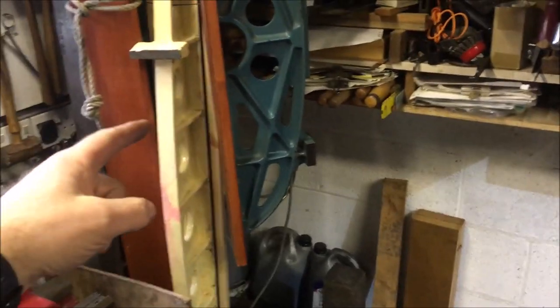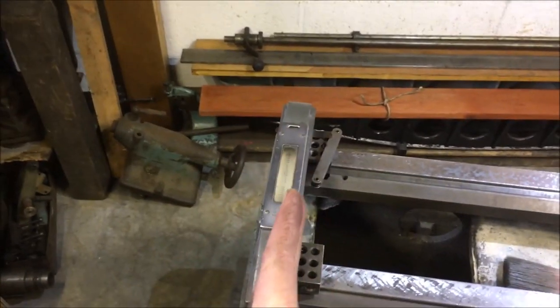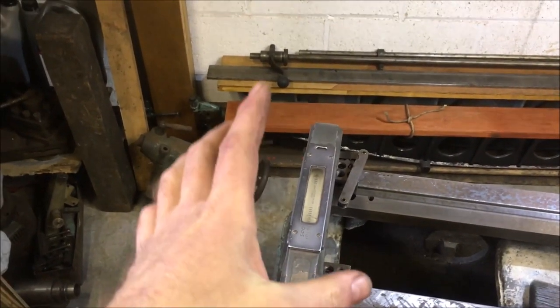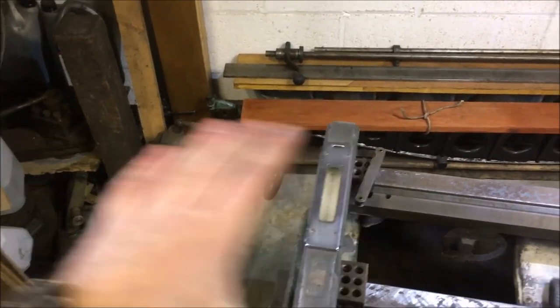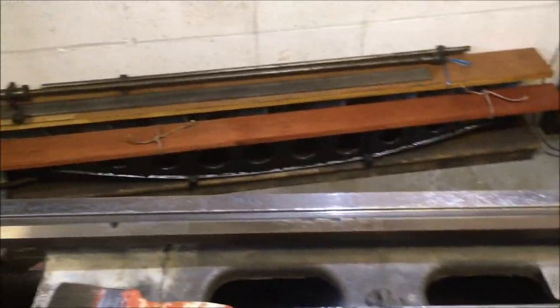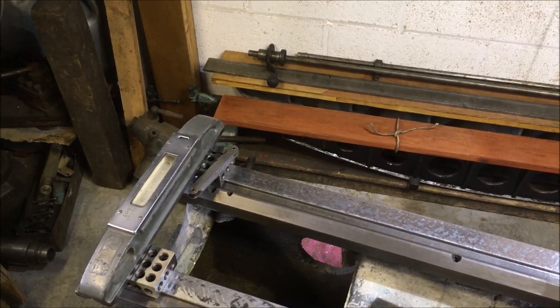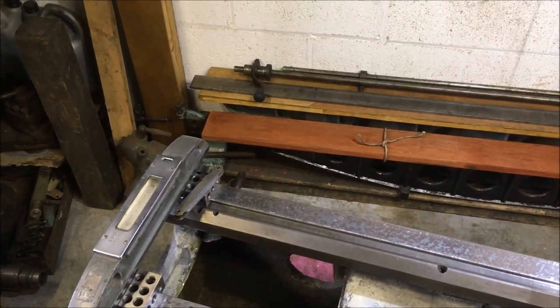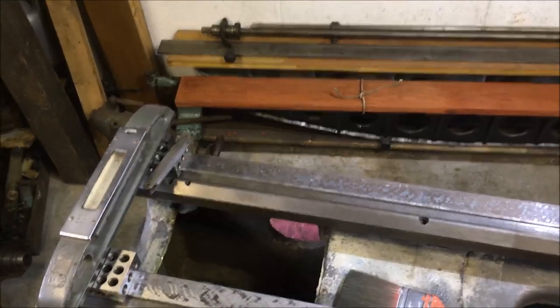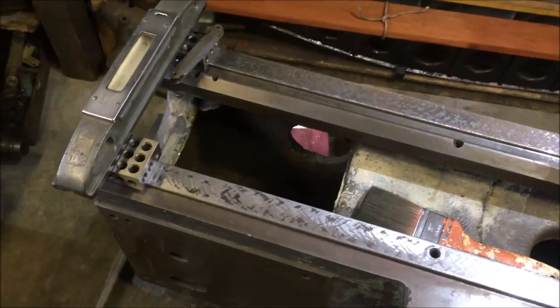So if you like, my workshop's, I think it's 6.5 meters internally. So you've got roughly 2 and a bit meters, then you've got this foundation, which the concrete slabs actually sat on, as well as the hardcore. So everything that side of it is a minimum of 12 inches of noggin-sized limestone nodules, and then MOT type 1 over the top to screen it off, and then it's got a visqueen, then sand and all the rest of it. And then there's at least 4 inches of structural concrete with reinforcing bars through it.